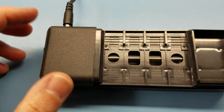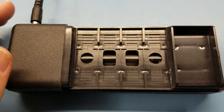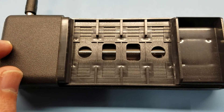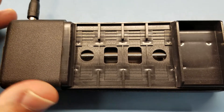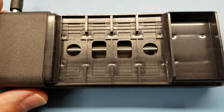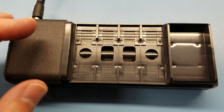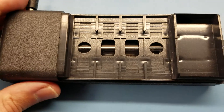I did recap the circuit board in this, and there's only four capacitors — I think there were like two 1-mic and two 10-mic, or something like that. But if you want to get one of these and you want to recap it, I would recommend opening it up and looking at the size of those caps first, because they're actually really small. The electrolytic capacitors I had laying around were actually far too big to fit into this vertical height, because the circuit board's right in the middle and you've only got that much height to work with. So I ended up just putting capacitors soldered to the bottom of the circuit board, laid down. It fits fine that way, but it's just not the way it was originally.